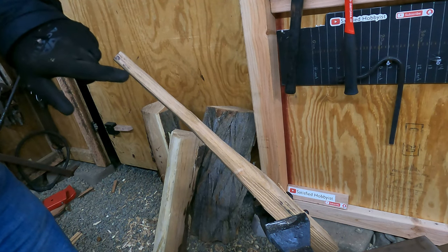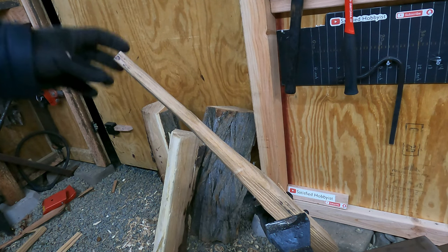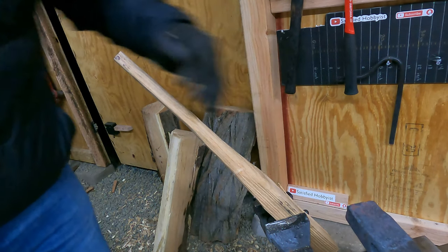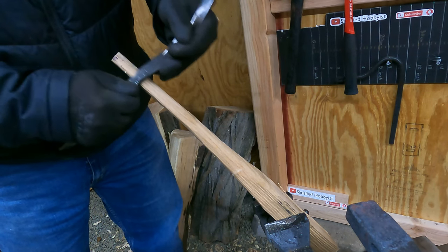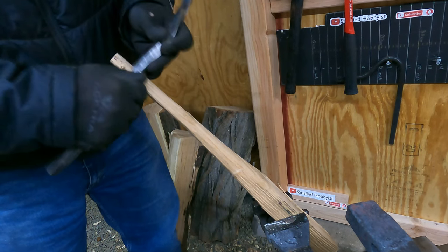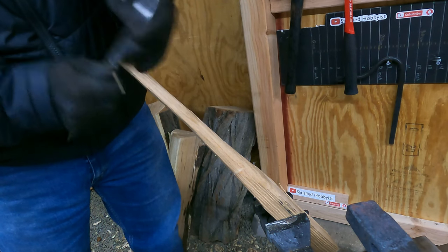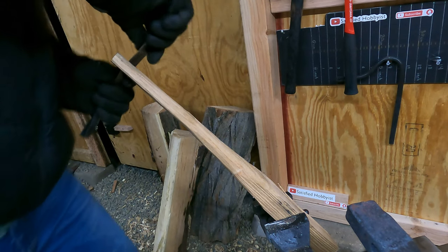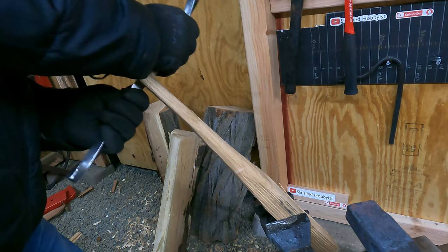You can see, hopefully you can see on the camera there, some lines, some little scuff marks that are transferred onto the wood. Those would be your first areas to shave down, not too much, because the fit was pretty good so far. But towards the thin side here I'm seeing a lot of interference. So just remove the little obstacles in your path. Like in the back here, it's more of just a central line, I see. I just made it two-pointed.